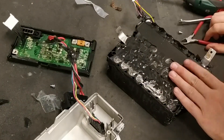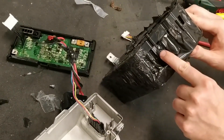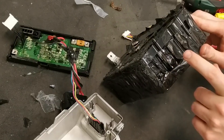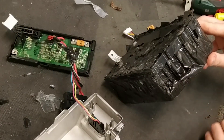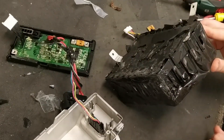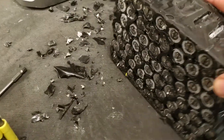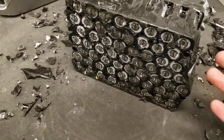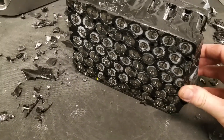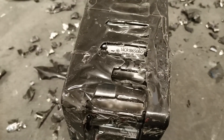And there you have the actual battery packed in silicone — there's just so much of it. Here you can actually see some hints I can identify directly as Panasonic cells. I think they are BD, but I'm not sure — these gray ones are usually BD. I removed all the nickel strips and unscrewed four screws, but there's just so much silicone stuck between the cells and the plastic holder, so I'm calling it a day. However, here you can actually see the brand name — it's the Panasonic BD cell.